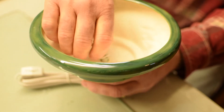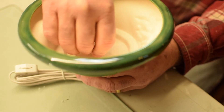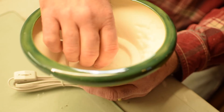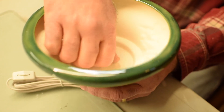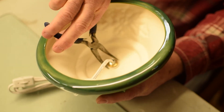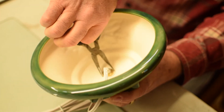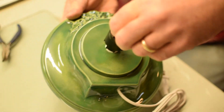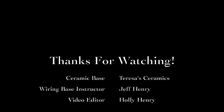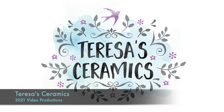Take your nut and your washer — the washer goes over it, and the knurl nut screws right on it. Just screw it up on there so it's snug. Then take your pliers and just grab a hold of the knurl nut and give it a firm turn, maybe a couple of turns, just to ensure that when you put the bulb in and tighten or loosen it, the whole socket doesn't turn. And that's it. Thank you.